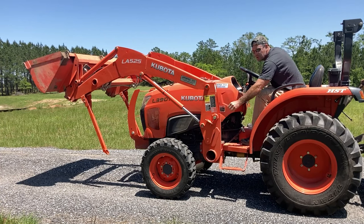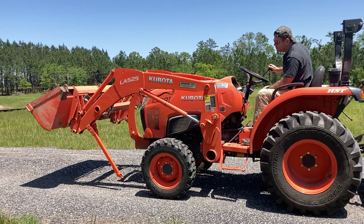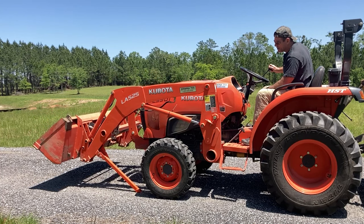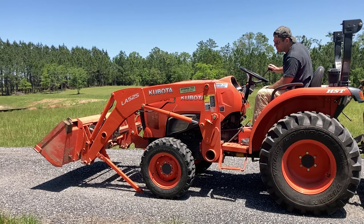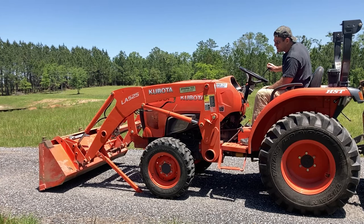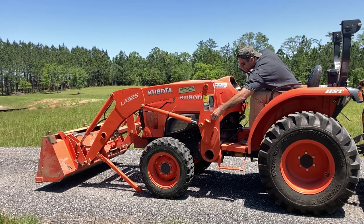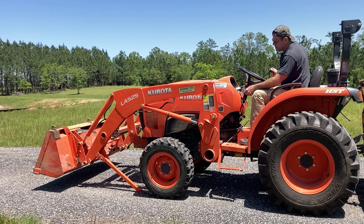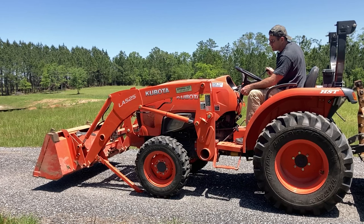Hopefully the audio is clear, but I'm pushing this down until the kickstands engage — they'll actually push back a little bit. You can see the front tires on the tractor are starting to lift up. I'll keep pushing down with my hydraulics; you can see my front tires are moving toward the loader.